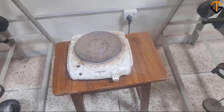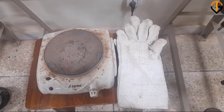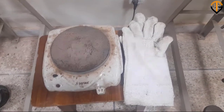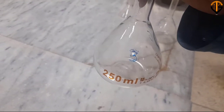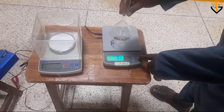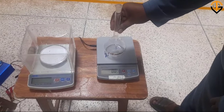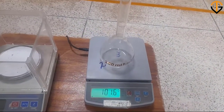In the later stages we'll get to know why we need to boil our soil sample. In the first step we'll note down the weight of the flask. We have marked the flask — this one is flask number 3 — and we'll weigh it using the balance. The weight of the flask comes out to be 101.6 g.